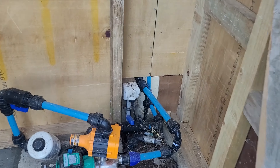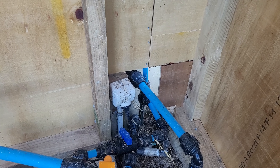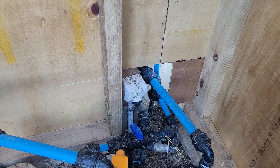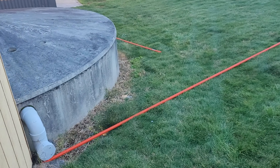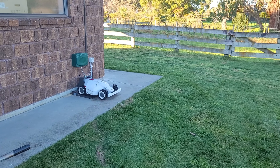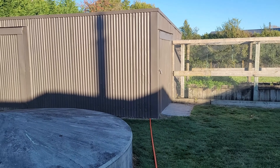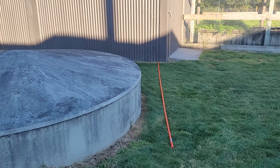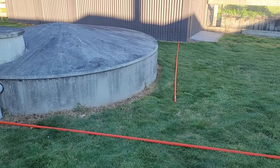Next job on the list is to replace the power point in the pump shed. This is a single power point and I've got a double one here - we need to take that off and put the new one in, one for the pump and one for the UV light. While we're doing that, I want to run power out to my shed - one of the jobs I've been thinking of doing is moving the robot lawnmower over there and putting the antenna up further away from the house. So while we're doing all this we might as well dig it in - it needs to be 600mm deep and you need to put a warning tape across the top.